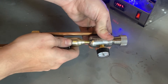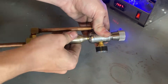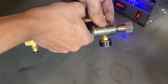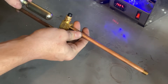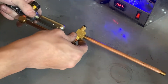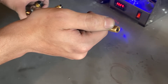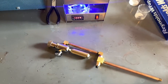The aluminum has fully melted and I'm going to insert a new CO2 cartridge into the degassing wand. One cartridge will last for about one minute at full pressure, which is about 40 PSI according to this gauge. The density of aluminum is about three times as high as the density of water, and I tested this in a bucket of water about three times as deep as my crucible — which leads me to believe this should have enough pressure to bubble through the aluminum. I'm going to start at a lower pressure for safety purposes.